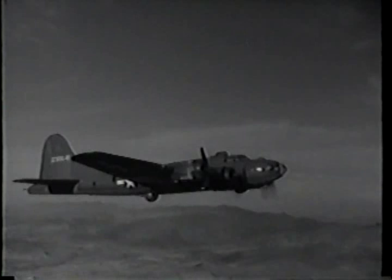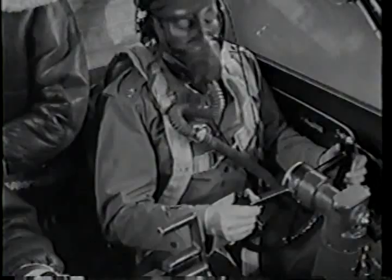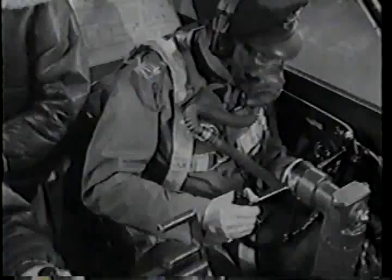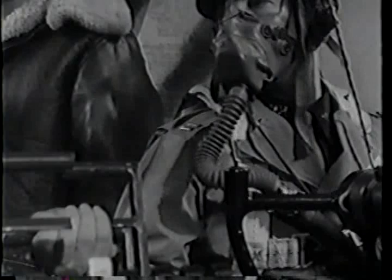Chances are the fire will go out if you use what you know and work fast so it doesn't get too much head start on you. Then you can get your airplane trimmed when everything's under control and clean her up. Get the ignition off on the feathered engine. Close those open cowl flaps to reduce drag when you're sure the engine fire's out and things are cool enough. And fly her back to base on three.